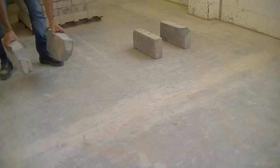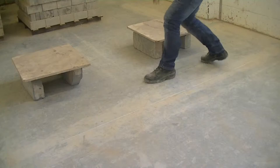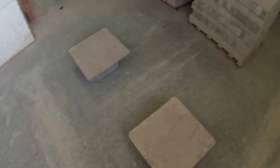The blocks I'm placing here are to put what we call your spot boards on top. Spot boards are what your mortar will sit on, and the reason we put blocks underneath them is to save your back — so you don't have to be bending down to the floor; it can be slightly higher up. You need a space big enough to walk between your spot boards and the line of your wall, which is roughly about 600mm — you don't really want it much more than that.